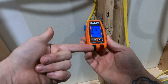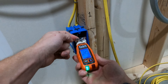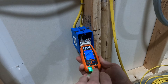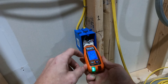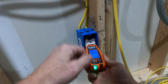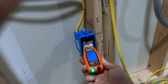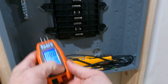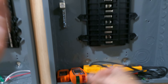One thing that recently came out is these little buggers. Klein developed a plug tester — it's the same thing as the last one, but it actually gives you voltage values, which is really cool. Look at that — it tells me 125 volts, that it's wired correctly. It'll let me know if there's a problem, if things are wired incorrectly. You can test GFCI too — if you've got a GFCI somewhere, you can hit test and it'll trip it. It gives you some useful information. And as an electrician, we need to know voltage; we need to know that information.